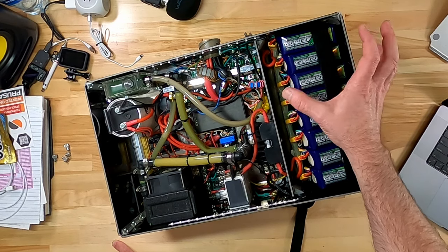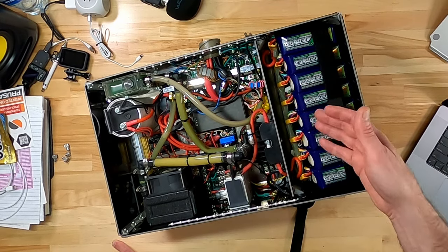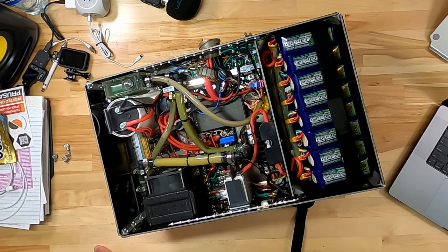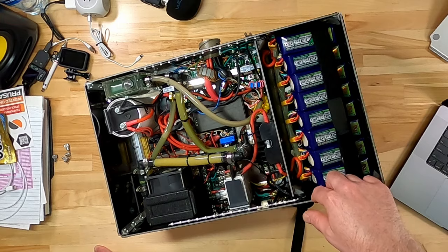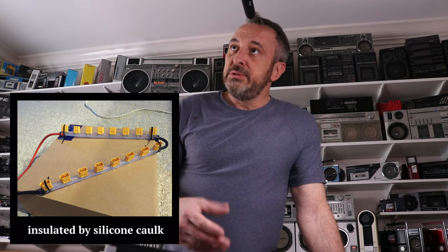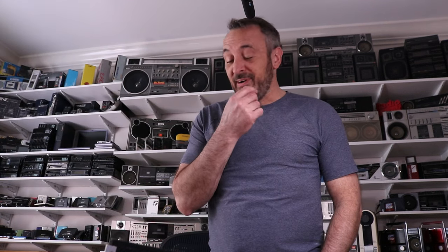They had a long lead on them, about six inches or so. We trimmed those off to save room in the pack—every little bit of resistance you can remove helps. We also made a custom bus of solid copper wire inside a piece of vinyl tubing pumped with silicone, which makes insulation for this custom connection. Because if this thing shorts, it goes nuclear.